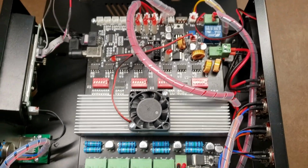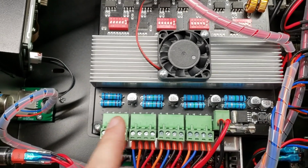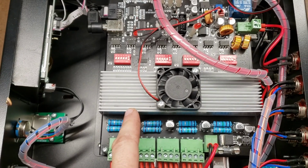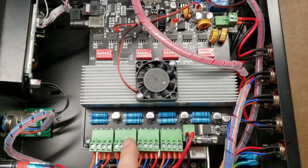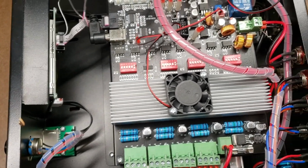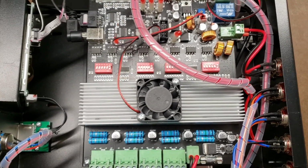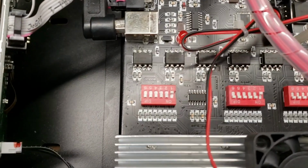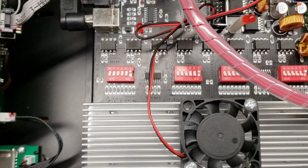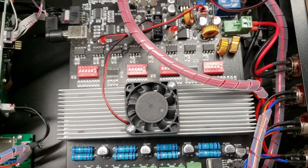and this controller is very interesting. It's big, it's huge. One thing I've noticed is that it actually has 4 stepper drivers, so it's technically a 4-axis machine, and it's got individual Y stepper outputs, and that might open up the possibility in the future to have individual Y-axis homing to make sure your gantry is always square. These flip switches, I'm gonna assume that half of them are for the micro steps and the other half might set the stepper motor current.